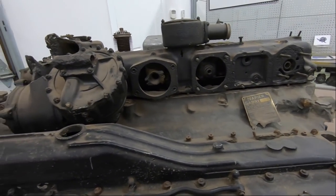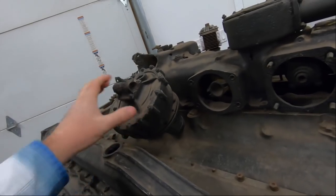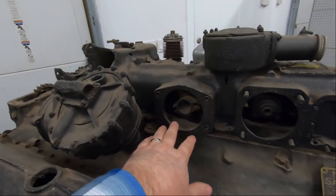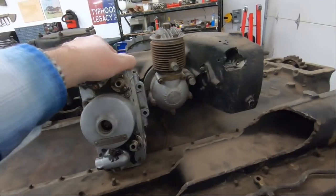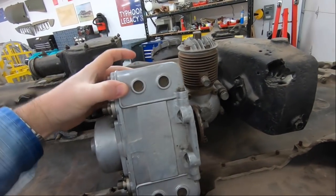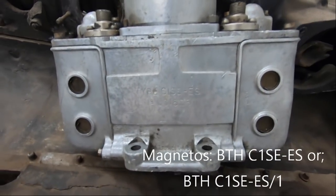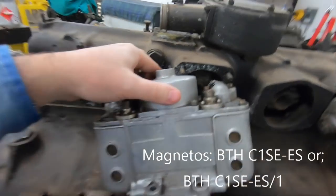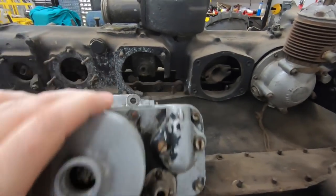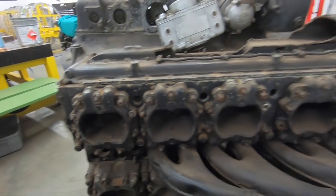The hydraulic pump is still attached — I recently purchased another hydraulic pump; they're Vickers-Dowty pumps. This is the location here for the magnetos — there's one on either side and then the distributor. Going to this side, we have one magneto at this time and we're always looking for more. These are BTH magnetos — British Thomson-Houston — just like on the Merlin. This is part number C1SE-ES with an Air Ministry stamp on it.